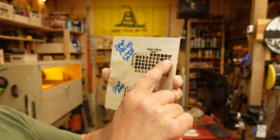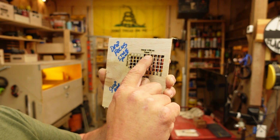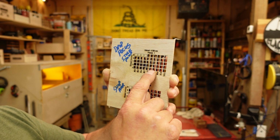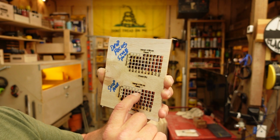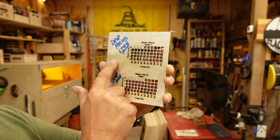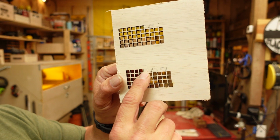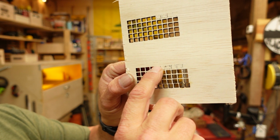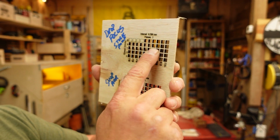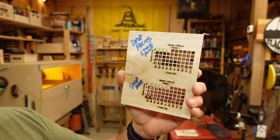As you can see, I was getting successful drops well into 8 millimeters per second and almost all the way down through 10 millimeters a second with the stock air compressor. And with shop air, it didn't perform quite as well with the drop focus. Now, you will notice there's a knot here, so I think the wood grain may have played a role here because I got some really good penetration, but the tops did not cut all the way through. So I'm gonna scratch that up too. That's basically going to be a tie, but I think the wood grain variations got into it.